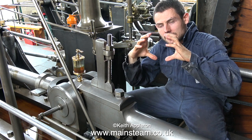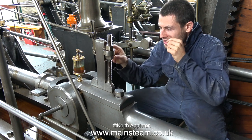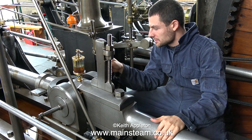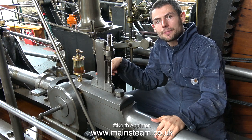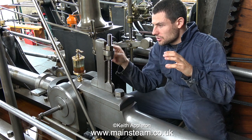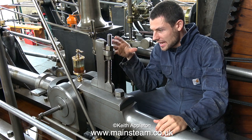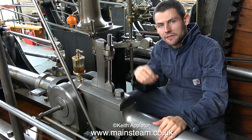You don't want it tight, you want there to be room for oil flow, and not so much room that the bearing knocks. The wedge precisely adjusts the position of the half bearing. And as the bearing wears, and the hole becomes oval, you move the wedge in to bring it back into the correct clearance. And only after 10 or 11 movements do you have to take the halves out and begin to remachine them.